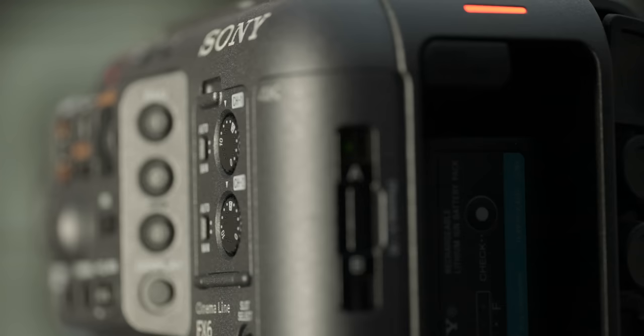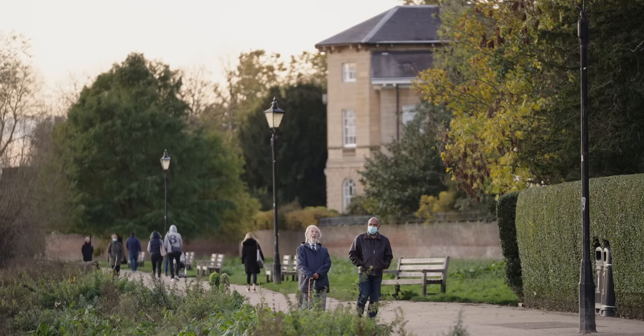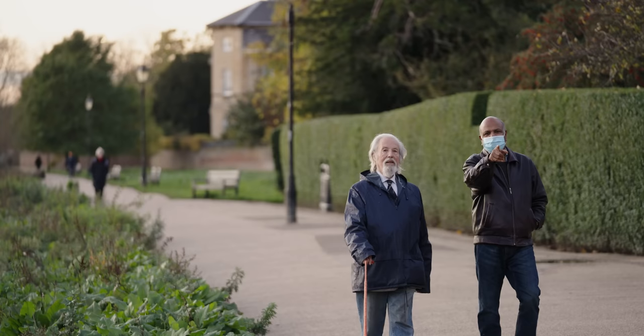As we're talking about RAW, the RAW out of the FX6, I haven't really tested, I had a quick look at it. It is out of the SDI, not the HDMI like the A7S III, but you don't need the extension back like the FX9, which is great. It only works in Cine EI mode, and so therefore only works at the base ISO and the high ISO. You cannot change the ISO to any other value, which of course makes it a bit more limiting.